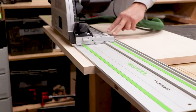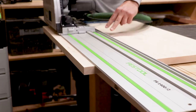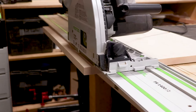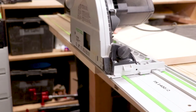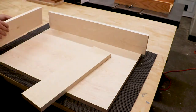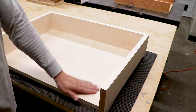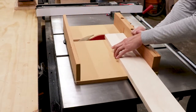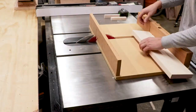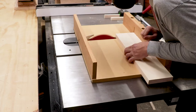Now that the bottom panel is one large piece, it's time to cut it to final size. Here you can see the rough shape of the board and how all the pieces will come together. I purposely left the back and sides a little long so that I can cut them to the exact size once I had the bottom put together. I made the cuts on my table saw using my crosscut sled. And if you notice on my last cut, I slowly sneak up on my measurement so I don't take too much off. I didn't make any extra pieces for this build and cutting too much off at this point would be no good.